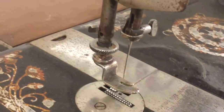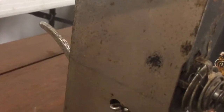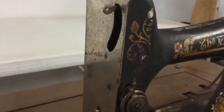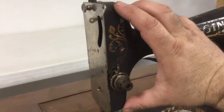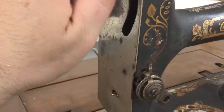On most machines like this it is done by using a Scotch yoke drive, where instead of the slot of the Scotch yoke being straight across, it has a V shape mounted in the head. In fact, that's why the heads of sewing machines are shaped the way they are, to provide a very wide area for the needle bar to have bearing on, plus room for the Scotch yoke mechanism.